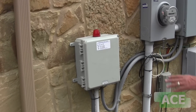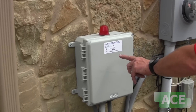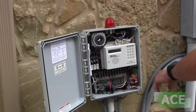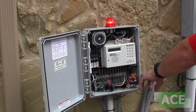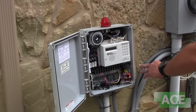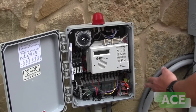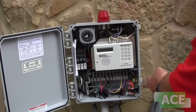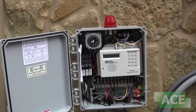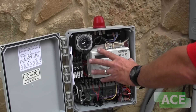What we have here is the controller box. It has our label on it and the different dates that we came and did the inspections. This is the alarm — we could test that real quick and that's what it sounds like when the alarm goes off. This button here, and most systems have some sort of button either inside or outside the box, can silence the alarm. If the alarm goes off, you just toggle that switch back — the light stays on but the noise goes away.